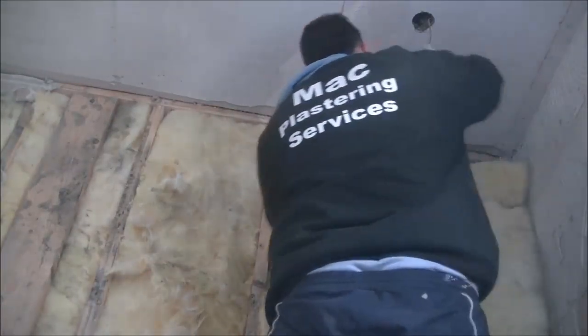You'll also need a hop-up or ladders to get to the top. First things first, I'm going to have to clean out any nails here. This is an old wall, so clean this corner off and make sure the board will sit nice and flat against the joists. If you don't, you can damage your board — they can pop through the other edge. So get your hop-up or ladders at the ready and clean down all your corners.